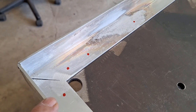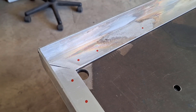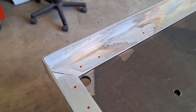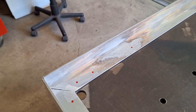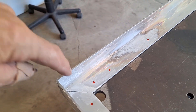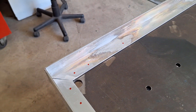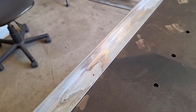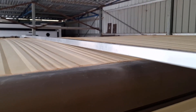With all the holes marked in pen all the way around the edge and through the middle, I can now centre-punch them all and drill them. I'm going to drill a 6.5 mil hole and use 6 mil domed Allen head bolts coming in from the bottom side. The slots in the solar panel are 9 mil wide by 14 mil long, so the 6.5 mil hole gives me a little bit of room for movement if needed to make sure all panels fit perfectly in this frame.